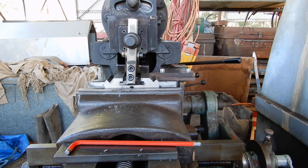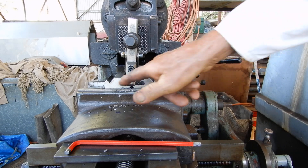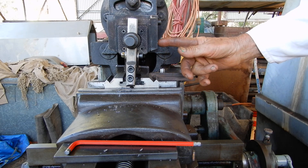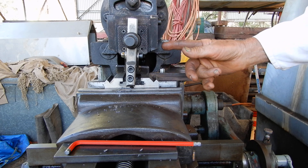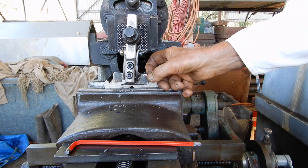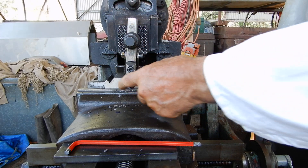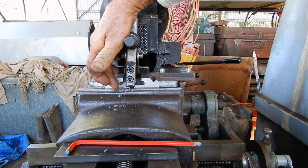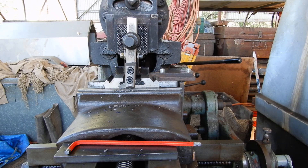The only other option is keeping it in the groove. The way they do that is they lock the clapper box — put a pin through there and lock your clapper box so that it can't move. But the downside of that is the tool wears. You get incredible wear on the tool and you have to sharpen it all the time.